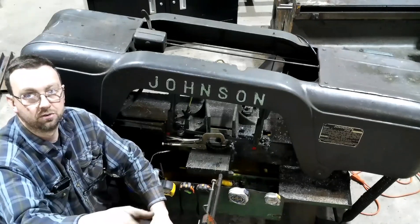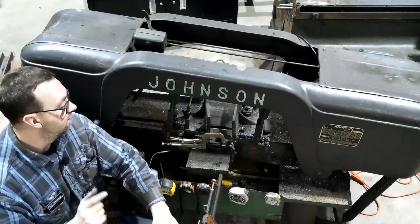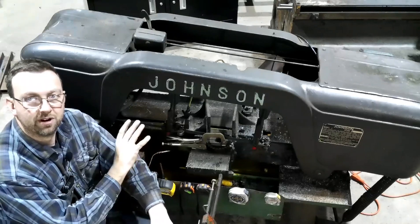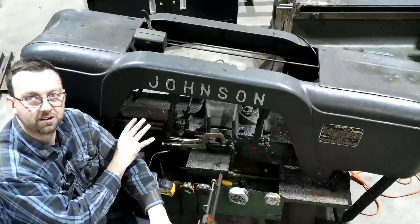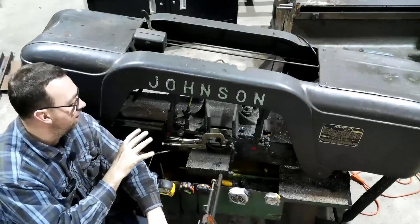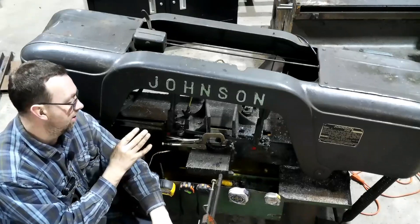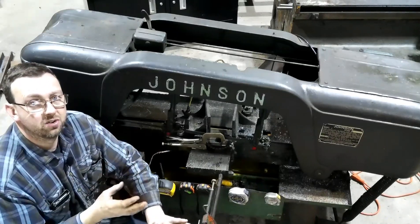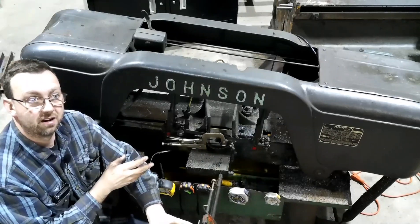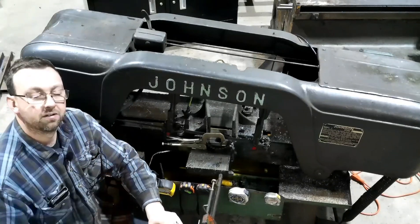This is number one. I've got number two and number three that I'll split, and then they can go together as a set when you're done. We're all clamped in here in my Johnson — if you want to hear the Johnson jokes, just go look for the Mark Twain Zephyr video. Anyway, we're clamped in here. We're just going to feed it nice and slow. If I was doing more than three of these — like ten or so — I would actually build a fixture. But it's not, so I'm going to take it real slow and just saw right through and split it open.